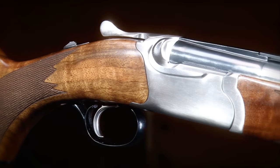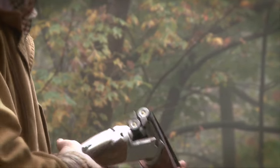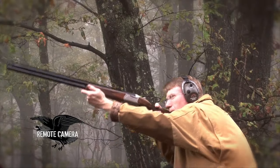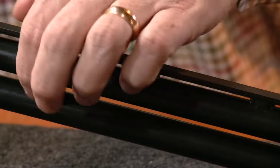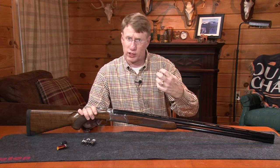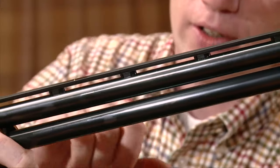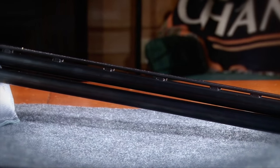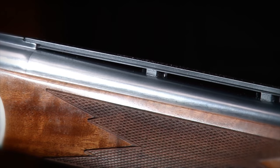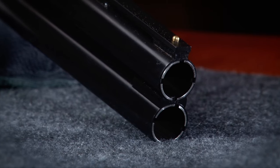It's an investment casting, but now it's made from only one piece. The Ruger Red Label has an investment cast stainless steel receiver, and the barrels are cold hammer forged at the Ruger plant. There are some changes to the barrels — there's no rib between them, and you have options on which kind of top rib you'd like. If you look carefully at the Red Label's barrels, they appear wider apart in the center than at the end, because the barrels are thinned in the middle. They're thick and heavy up by the monoblock and also at the front, where the gun has interchangeable choke tubes.